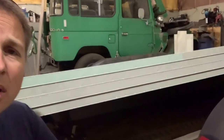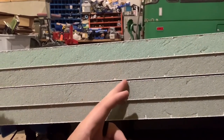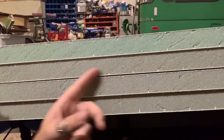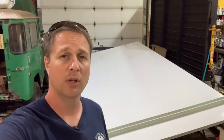One of the things that I've noticed is on the inside where the foam and the panels are glued together, you can see there's a lot of little ticks in between the foam and the outer panel interface. And that's allowing more glue area to go into the foam, which makes the bond between the layers significantly stronger. The panels themselves weigh about one and a half pounds per square foot and the outer layers are fiberglass. The fiberglass in this case is a polyester resin with both veil and roving. The finish on the outside is a white gel coat with a UV inhibitor. The finished panel thickness is about 36 millimeters or just under an inch and a half, and each of the layers of fiberglass on the sides are around a millimeter thick — so about 34 millimeters of foam and 2 millimeters of fiberglass and gel coat.